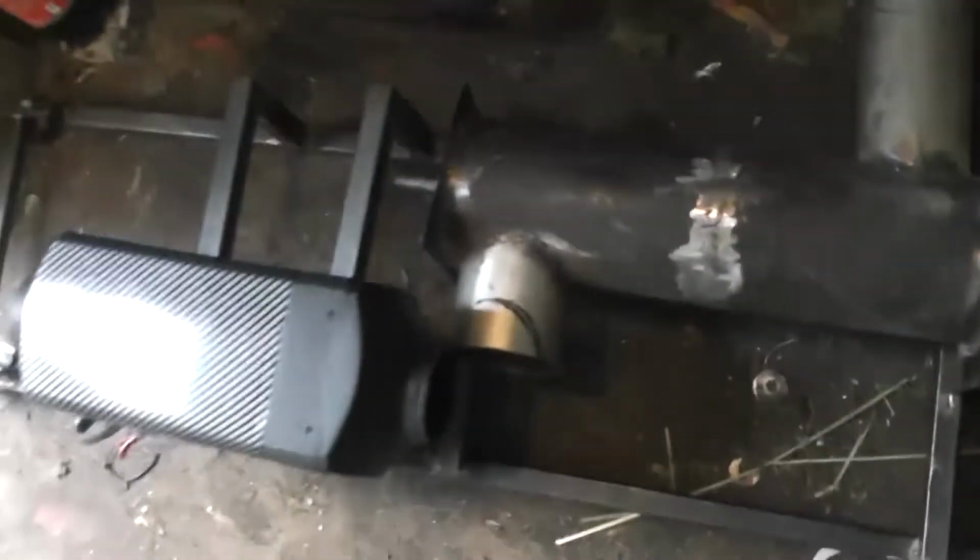Exhaust pipe from the heater out, straight into this pipe. Sealed chamber, positive pressure inside. Exhaust fumes can't get into the chamber from here. As long as this pipe is not compromised, the fumes cannot escape into the airflow. If they do, we're all going to die. Exhaust out. This is the basic gist of where I'm going.